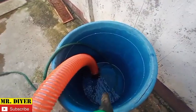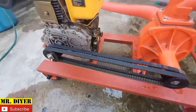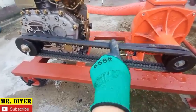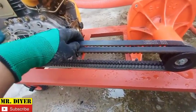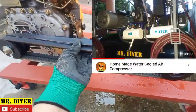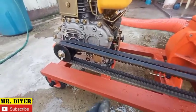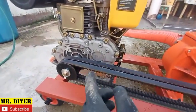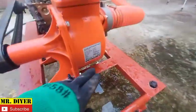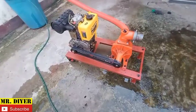One of the problems is this belt is loose while this one is tight, even though they are the same size. This used belt is from my air compressor — you can check that video out — so this one is used and this is new, that's why it's wobbly. Another reason I believe it took a while is that I had this engine running at only 3000 RPM, and it requires at least 3400 RPM. So I'm going to increase the idle next time.